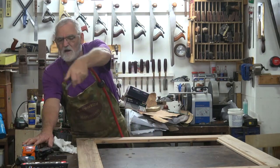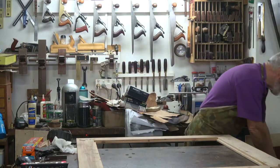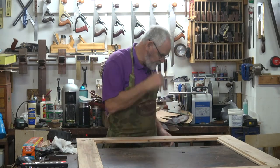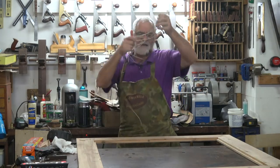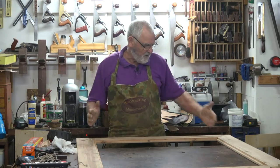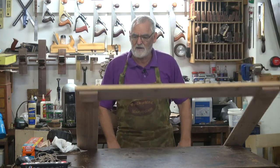Sorry about that if you got dust in your lounge room. The frame's that big, I haven't got clamps big enough. So I had to put it on the floor, clamp it together using the Nobex string clamp. This thing here is an excellent bit of gear, but it does have its shortcomings. One of the shortcomings is you can't get the pressure on the middle of the joints. So I had a couple of little gaps. That was another reason for the rondelles, to cover that up.